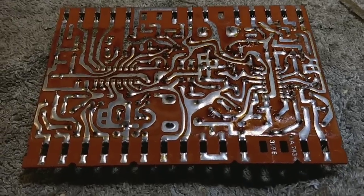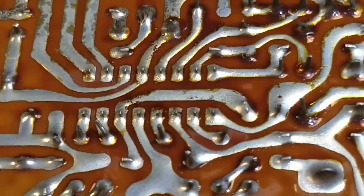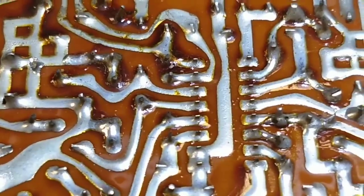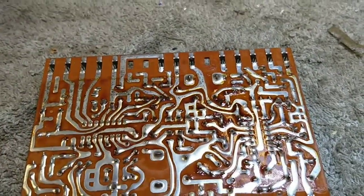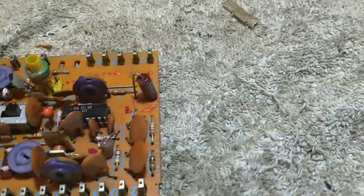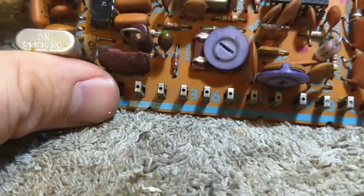So taking a look at this board, I can already see that there's some not very good soldering that's starting to break down on these IC sockets and the switches here. Looks a little crystallized, looks a little tired. You can see the darkened areas of the board here where the heat buildup is kind of taking over. And you have to watch out for these IC sockets. They're old and primitive. And it looks like actually somebody was scraping on that one. So there may be an issue there.